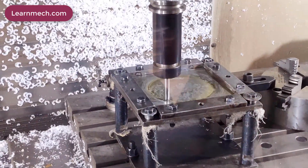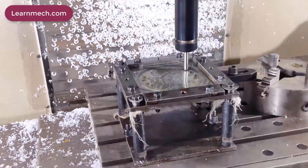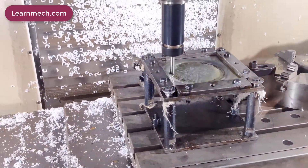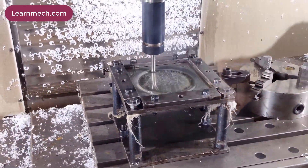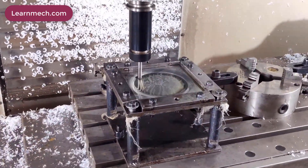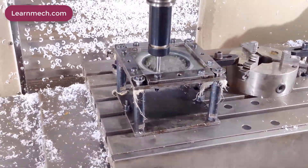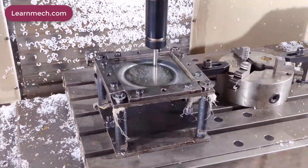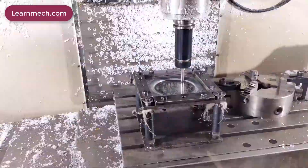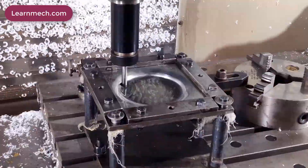In this video we will see how to form a hopper shape from a flat sheet using a VMC machine. Generally, for metal spinning, CNC lathe machines are widely used. On a lathe machine, the workpiece plate is rotated at high speed, but only circular symmetrical parts are possible. Spinning on a lathe is done by hand, so the operator must be skillful for this type of forming job.